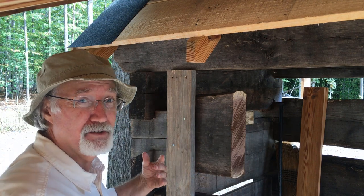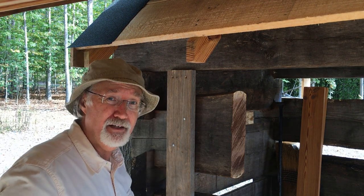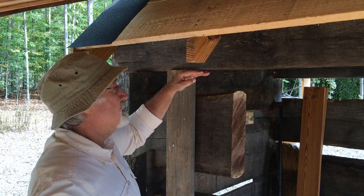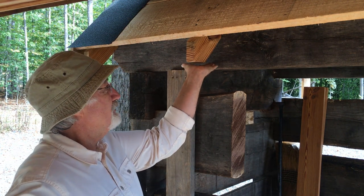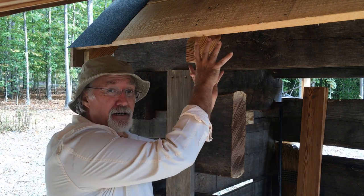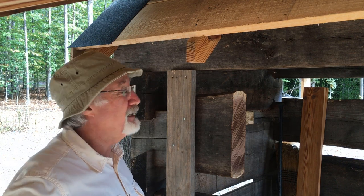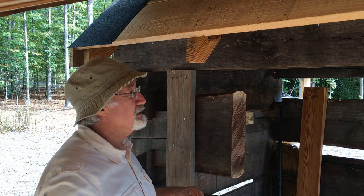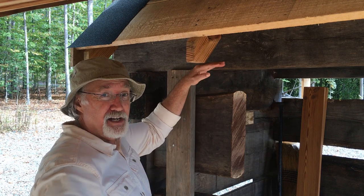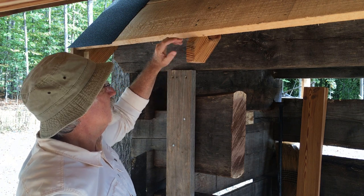Another aspect in a more refined home would be the soffit — the flat board nailed to the bottom of the rafters — where the fascia would cover it over and create a boxed-in eave. Here I'm going for a blend between that rafter-tail rustic look and the more refined boxed-in fascia-and-soffit combination typically seen on new homes.